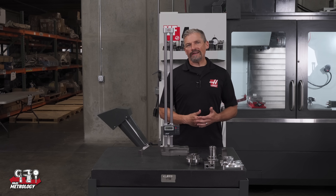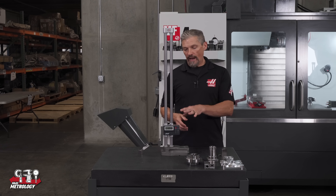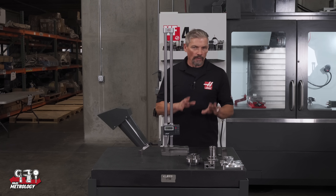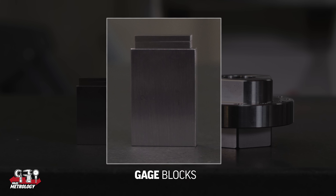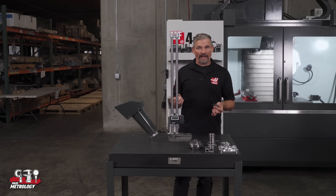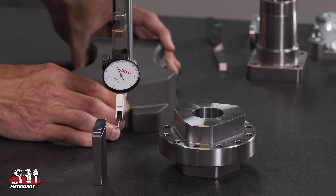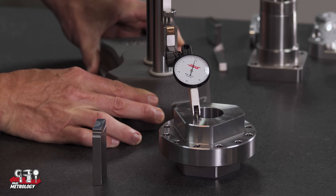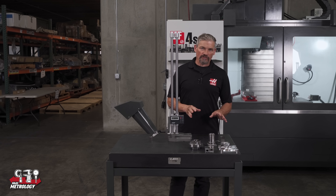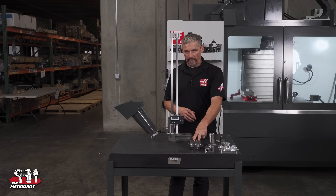So what if you need a more accurate measurement? There's a pretty simple way to do it: use the height gauge as a transfer stand. This means establishing an accurate height measurement with something like a stack of gauge blocks, setting our indicator zero on that stack, and then without moving the height gauge carriage transferring that measurement over to our part. This can give us a very accurate result. Let's stack some gauge blocks together at a specific height to compare to this turned and milled part.